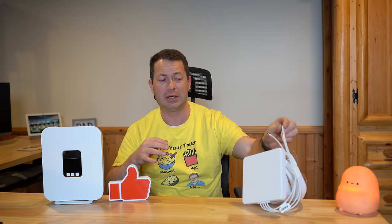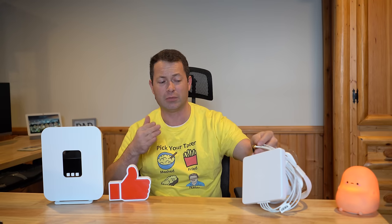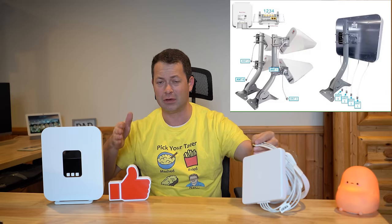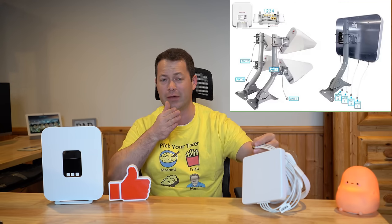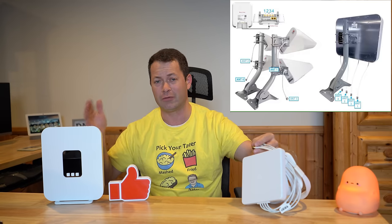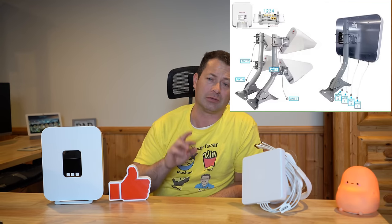I'm going to do the Waveform 4x4 antenna, instead of antenna lead 3 to 3, because of the antenna waveform order. It is typically, for this device, going from 1 to 4 on the antenna ports here on the gateway: Waveform 1, Waveform 3, Waveform 2, Waveform 4. So you actually reverse the middle two cables so that they're not 1, 2, 3, 4. It's actually 1, 3, 2, 4. Let's hook that up. And then I also have a Waveform 2x2.